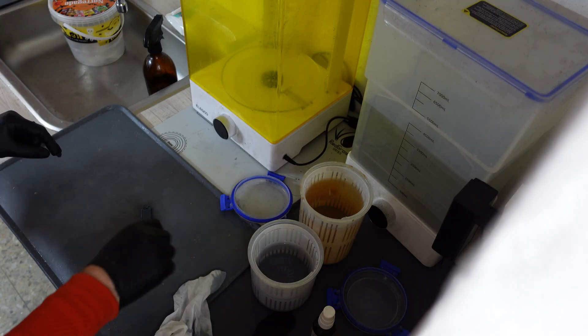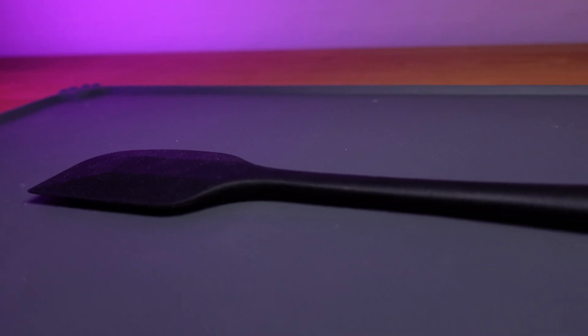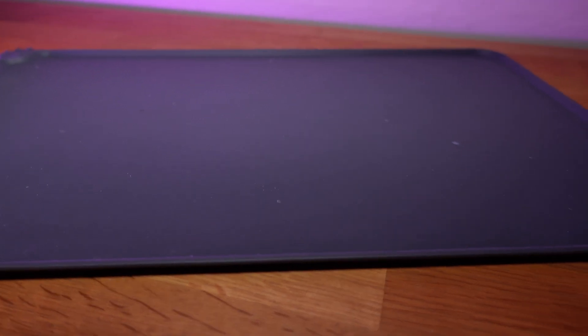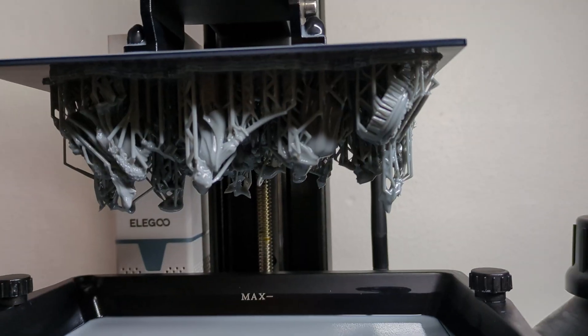The printer is also noisy. For the actual cleanup of the prints, what you need depends a lot on whether or not you want to use only a water washable resin or a resin where you wash with alcohol. I recommend beginners starting out with a good water washable resin, as it will severely cut down on the amount of supplies you need and makes things less complicated. In both cases, you will need a silicone spatula to stir and mix the resin as well as to feel the FEP for any bumps or tears. You will need at least one tray or mat for cleaning, and often I recommend getting one to place underneath your printer as well. Both silicone mats and metal trays work fine. To get the models off the build plate, you will need a sharp plastic scraper.